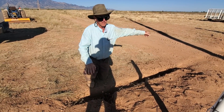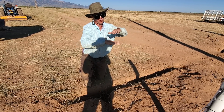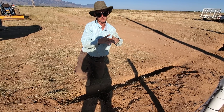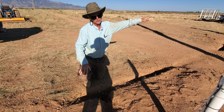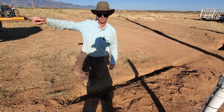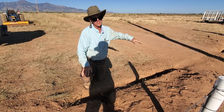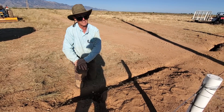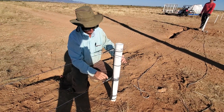We've got an inch-and-a-half high-density polyethylene water pipe in that trench as well. I was concerned about the road crushing our water pipe, so we put it in a steel pipe — a two-inch heavy-wall steel pipe under this road. You're going to have road traffic, because we're going to have a corral over here to load livestock. If you've got a road on your farm, make sure you put your water pipe inside a steel pipe.